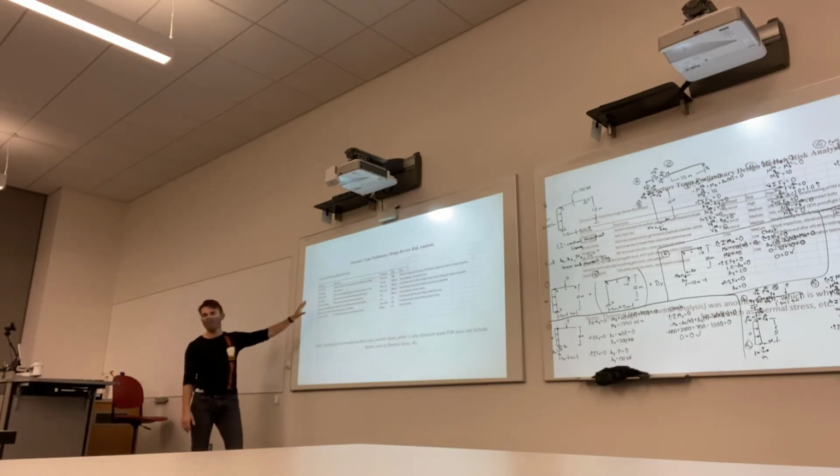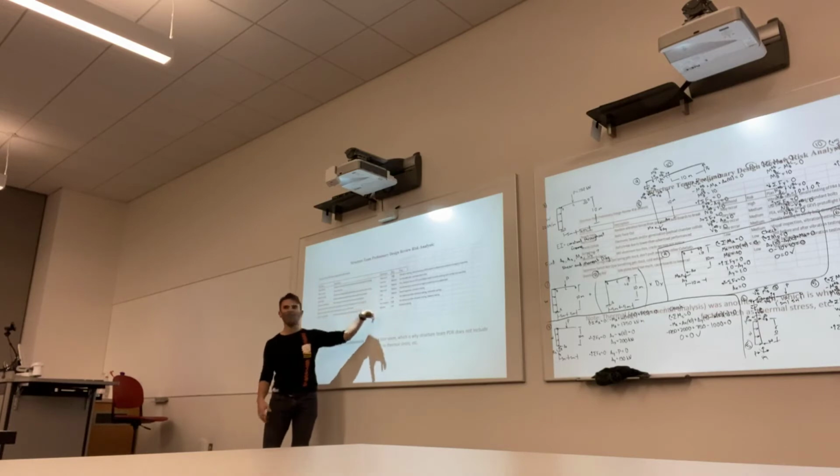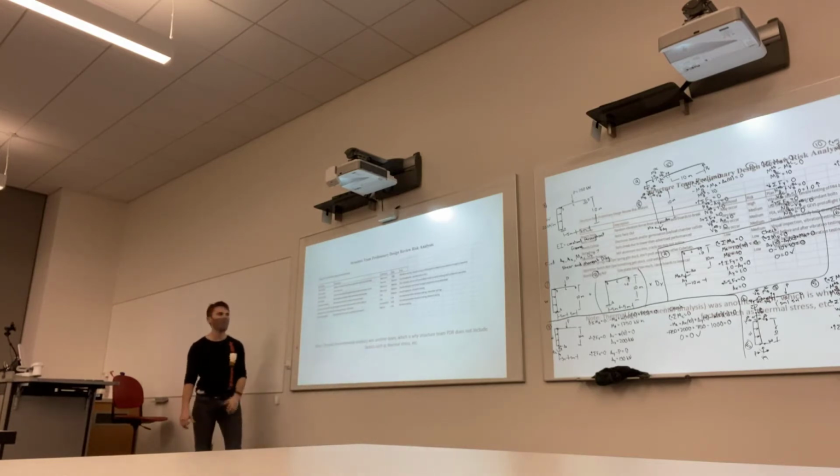And this is, of course, a first pass. As you develop the thing, you may find other things that come up on this. But yeah, you say the risk, describe what it is, what your first pass likelihood estimation is of it happening, and then you come up with a plan for how you're going to mitigate it, which in the case of the hardware is mostly random vibration tests, which if you're not familiar, we'll talk a little bit more about that later.